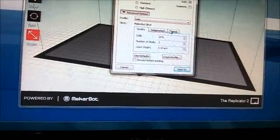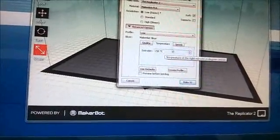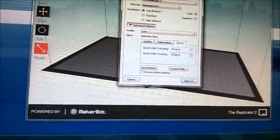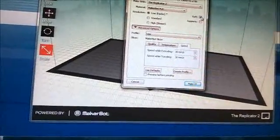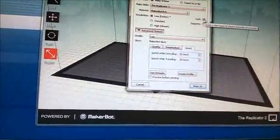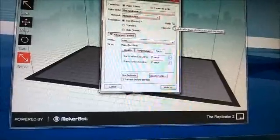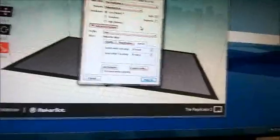Let's review really quick. My Replicator 2 didn't heat up well enough, so I had to increase the temperature to 250. It was also recommended by a lot of people to change the speed, so I slowed down the speed quite a bit for using this rubbery material. It looks like by using the tape I don't have to use a raft, though I did use one this time and it took a lot longer. That's how I used NinjaFlex on a Replicator 2 — thanks for watching.